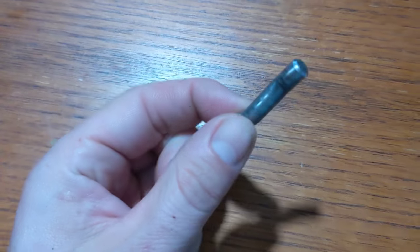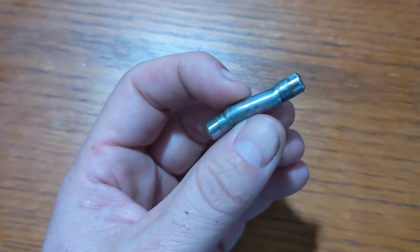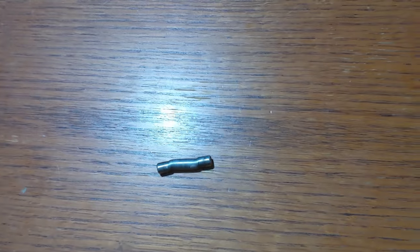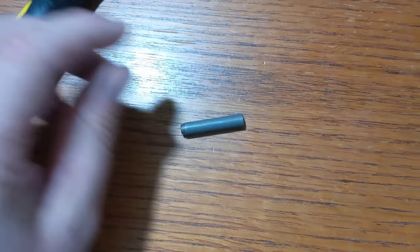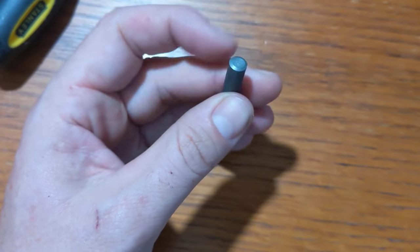The forecast for the rest of this week is just constant rain so I'm not going to get this out to test again — I'm going to wrap up this video. But really quick I want to show you what went wrong this last time. I had a lot of trouble driving that pin out of the propeller — that is supposed to be a shear pin, strong enough to hold the propeller on but not so strong that it holds on if you hit a rock. The one that was in there just bent somehow and was really wedged in there — I destroyed two old screwdrivers trying to pound it out. I had some pins which looked like they'd be correct for the boat, but apparently they are not very strong and these ones just sheared off under normal use.